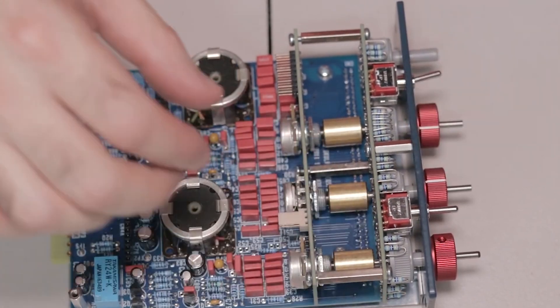I can see where you're coming from with the three gain stages. In a real Neve, there's a gain stage for the mic and line inputs set differently, and then you also have the output stage. That's not completely necessary to have those three stages — there are ways to get around that in the circuit topology, which SoundSculptor and other clone manufacturers have done. However, a genuine Neve 1073 preamp doesn't have to have the EQ in the circuit. There are AMS Neve preamps that don't have the 1073 EQ. If you want the complete topology including the EQ circuit, SoundSculptor actually offer that EQ circuit too — so they do complete that circuit in their 500 series design.